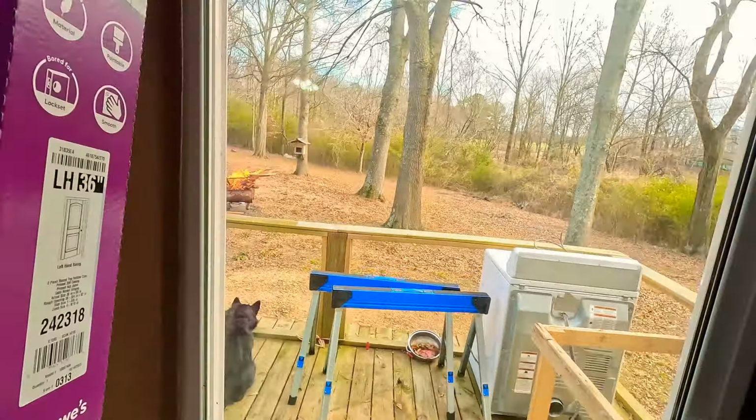So that would be good. I got the floor hole taped up. We're going to have to cut some blocking and whatnot to patch up this hole. I'll run some 2x4s, scab underneath, and we'll scab a piece in so we can cover it.